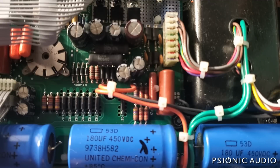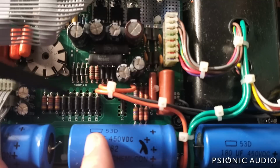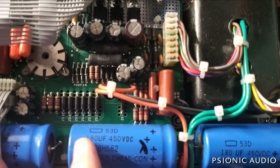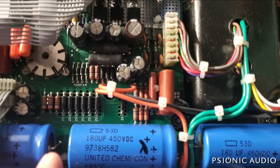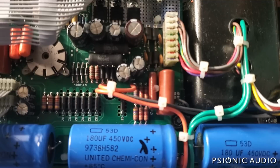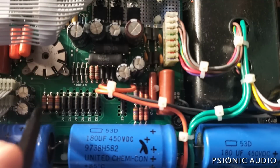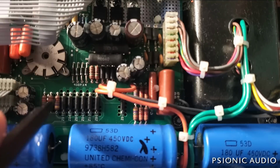screen supply. Mesa loves to do weird things with high voltage, and so this is where they're doing that with this string of Zeners, every one of which should be mounted off the board higher. So it's not all that likely that any one of these three resistors would be bad in parallel with each other. They're all going to share the wattage to a degree.